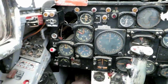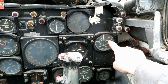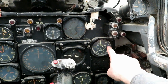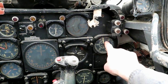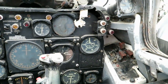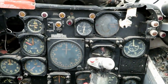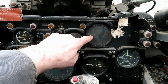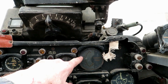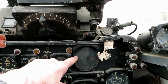You sit here and let everything do what it's got to do. Eventually this settles in at around 38 to 41% RPM — the big hand comes around to about there, and the tachometer goes around all the way to 100, going around twice. Your EGT is going to settle into probably around 700 degrees Fahrenheit.